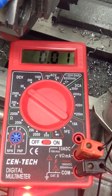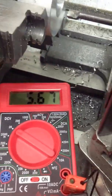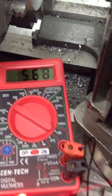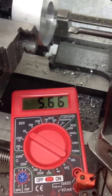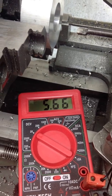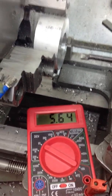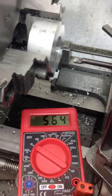Now if I touch down, you can see it drops down to 10 milliohms, 0.01 ohms. So at least for the Model 100, it's very easy for the circuit to detect the difference between 6 ohms and 0.01 ohms. So hopefully this will put some numbers behind the kind of behavior that at least the beta testers have seen,